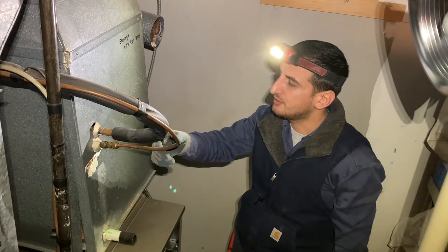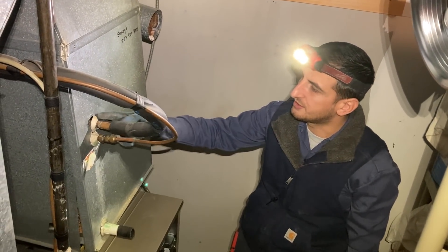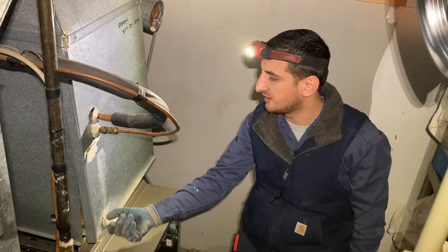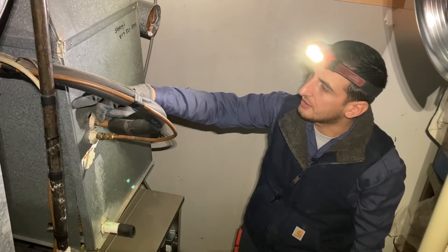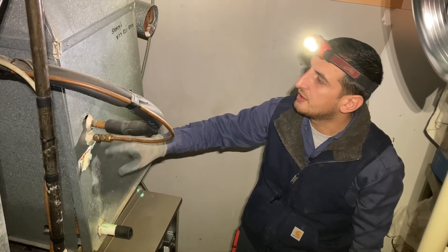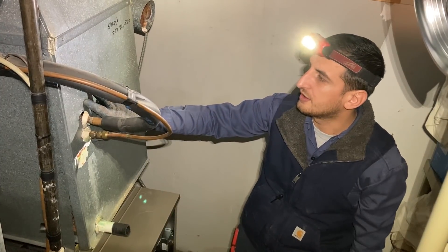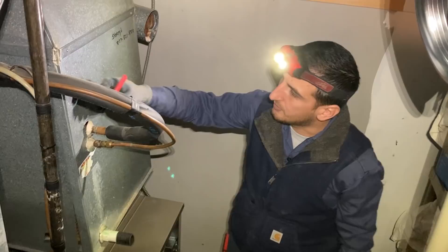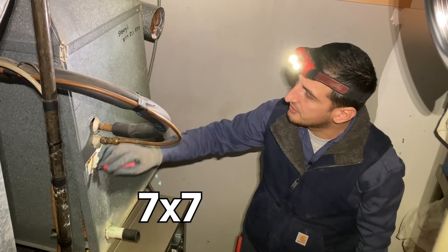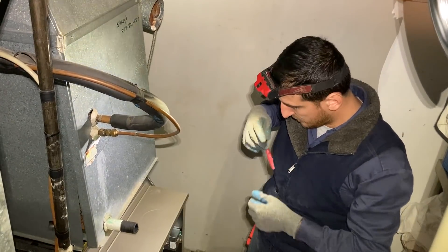Because we're not gonna be able to disconnect the line sets, there are two holes here where wires come out. With the condensate it's easy enough — you can remove it. With the line set you cannot, so we're gonna cut a square piece here, keep this piece, and put this on our new piece — something like maybe seven by seven. We're gonna cut that and keep that piece.